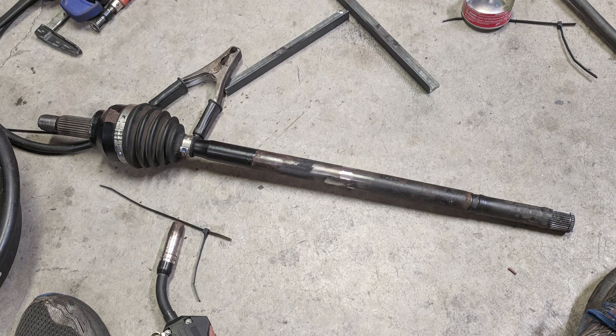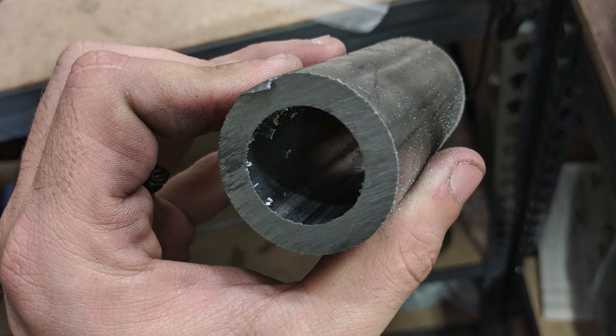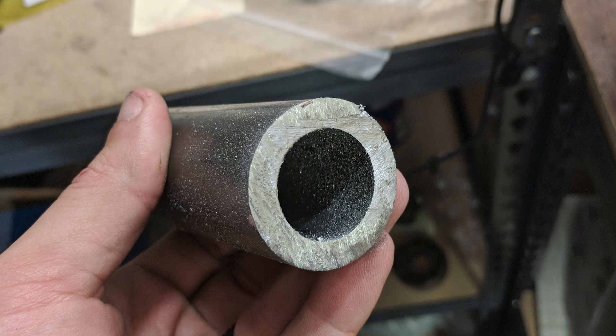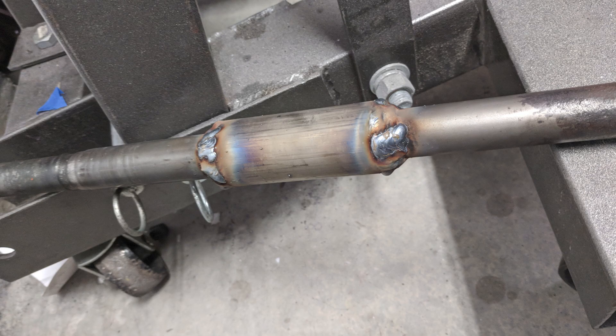Once you get that all set in place, I went ahead and ground down those welds flush. You'll actually see that the two axles are slightly different diameter — you can barely tell it in this picture — but you are getting roughly 0.01 inches size difference. And so we have this quarter inch wall sleeve now that we're going to go ahead and machine to fit perfectly over the axle and slide over it. We machined the ends down to get a better profile, and we machined the inside of it out so that we're able to get a much better fit on the axle since they are two different size diameters — so not an interference fit, but essentially a perfect fit.